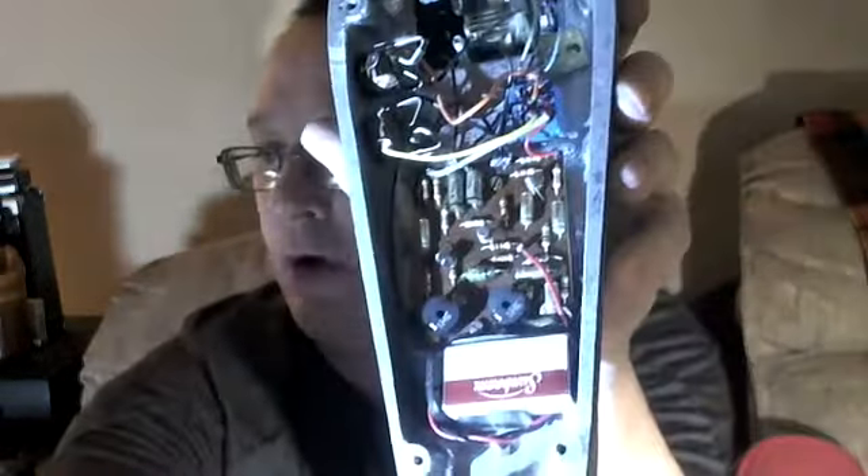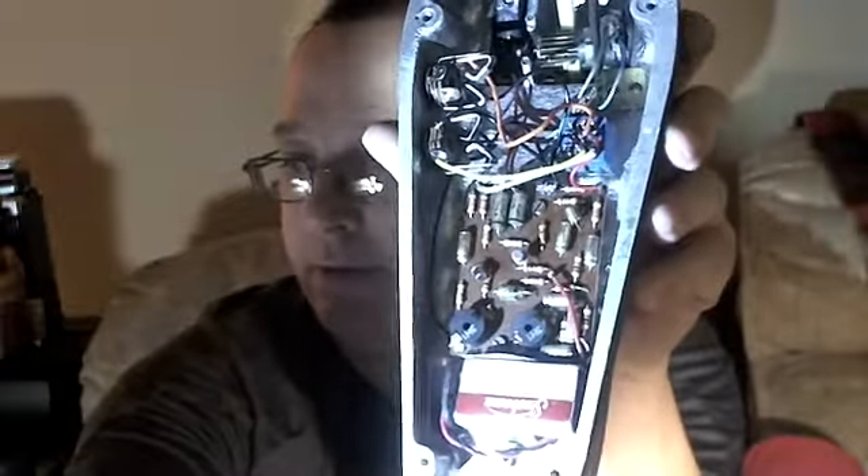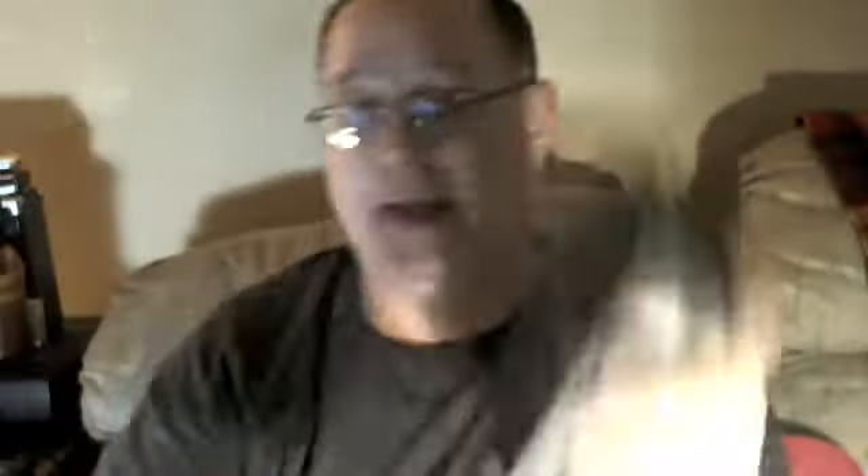So this is version one that I'm talking about. My circuit board looks like this, with the two inductors at the bottom. I'm going to be talking about the PCB, the pins on the PCB, what they are — so you could rewire this if you needed to, because people probably do with that switch failing. It's not labeled, and it's not labeled in images on the internet. You could figure this out by testing the components and comparing them to the schematic diagram, but this may save some people some time.